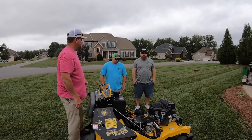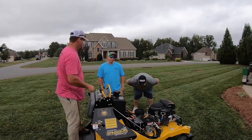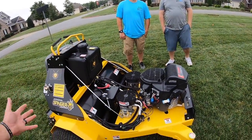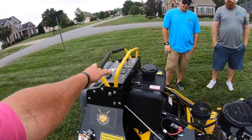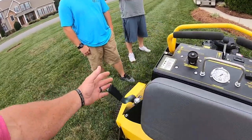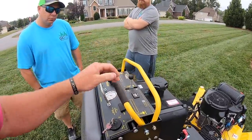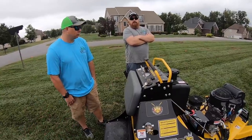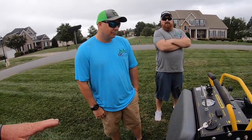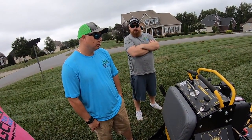This is a full commercial, electronic fuel-injected machine — I'm not sure on the exact horsepower but it's strong and big. The way it operates: the engine makes everything go; you have hydraulic pumps here, and when you compress or push the control forward it sends hydraulics to the wheel motors, which turn the wheels. Parking brake right here, key, throttle. During our test run we're going to run at about half throttle just to let you get used to it and comfortable — turtle speed.